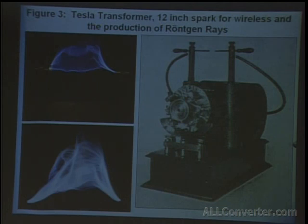The automatic circuit controller, hand switch, and connecting posts are mounted on the front plate of the inductance spool, as are also the contact springs. The condenser box is equipped with three terminals, the two external ones serving merely for connection.